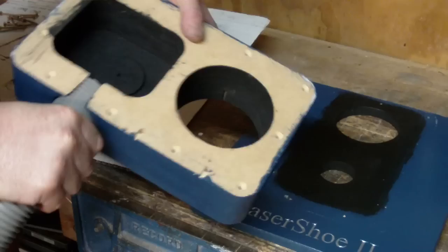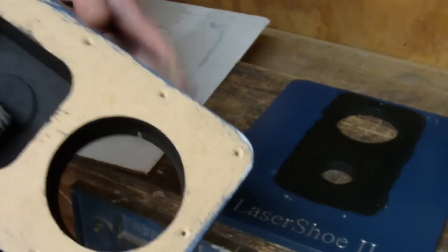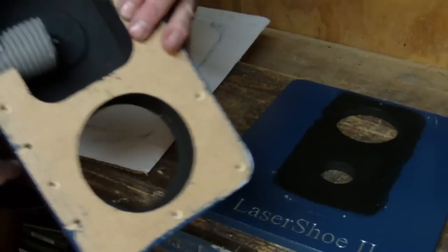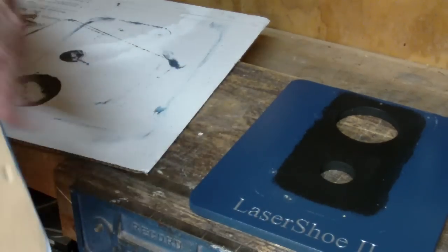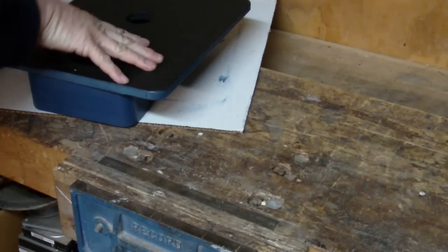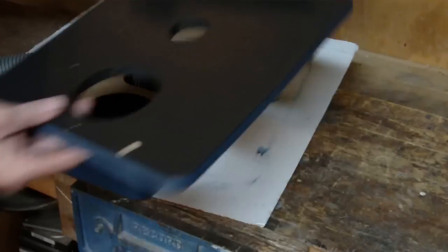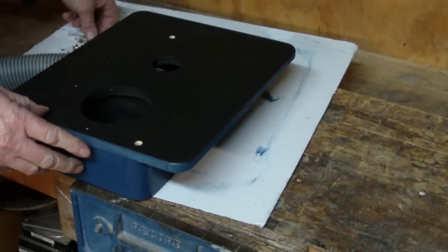So basically this just pushes in here, and just pushes in a wee way. Just don't cover the small hole here, so I'll just bring it back a little bit there. Now you notice as well it's just pushing through a little bit prior to this point here, and that's where having that go through is good, because it means when this is screwed down it's going to tighten up the pipe there when it pushes down into there. Okay, well now we're ready to screw the bottom on.